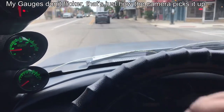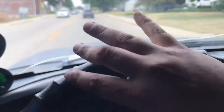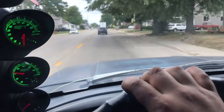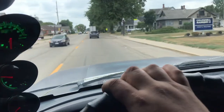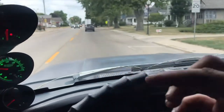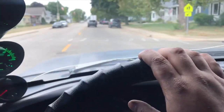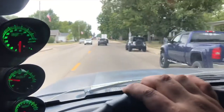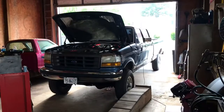I think there's three things wrong that I've been meaning to address — actually four things. There's a little bit of tautness in the throttle cable, so it won't give any consistent idle because it's basically resting on the cable rather than resting on the idle control screw on the back of the p-pump. I've also got to look at that stripped-out bolt on the fuel shut-off solenoid.